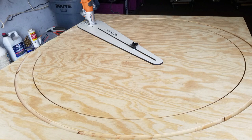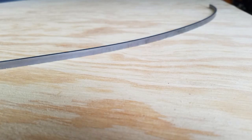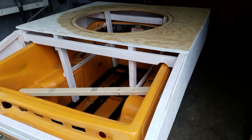Fabricating the turret ring was probably the most challenging part of the project. Before I could cut out the turret ring and the hull on top of the deck, I had to route a couple of grooves. One was a flat stock groove, which you can see here, and then another groove would be big enough to hold number 40 chain. It was critical that these two grooves would line up with one another as the turret ring sat over the hull deck.